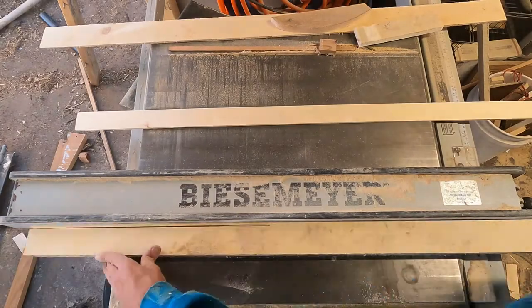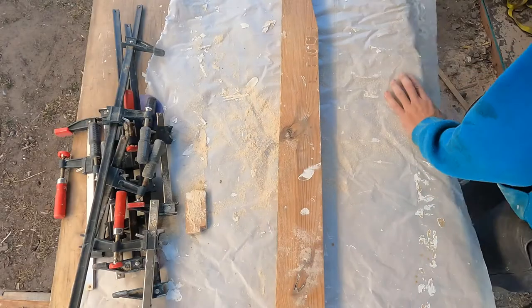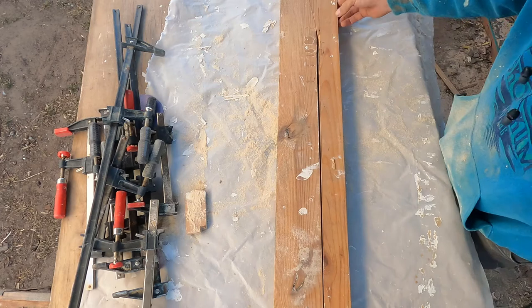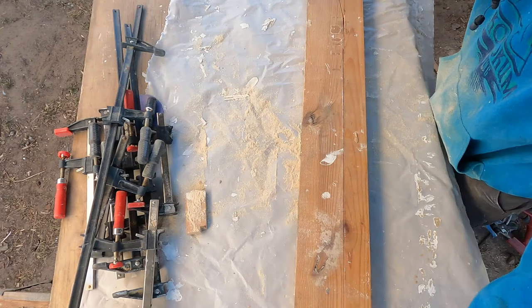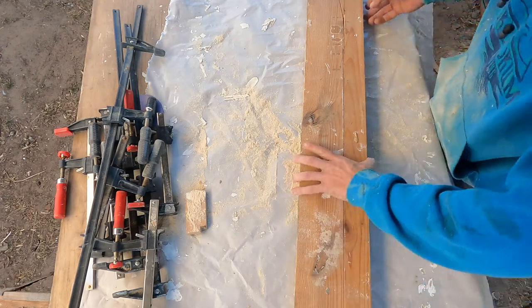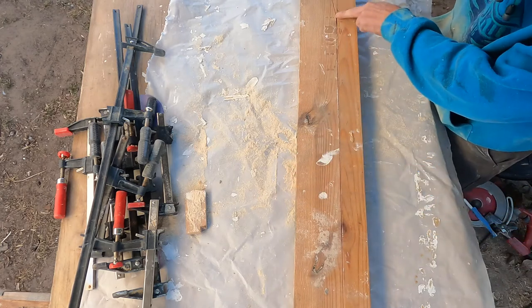To do that, we're gonna first make a bunch of strips so we can make the bent shaft of it. So I made this jig. The way I did it, I just took a 2x6, I cut a 2-inch strip down most of it, and I want my blade to be 14 inches long. I don't know why 14 inches is what I wanted, so that's what I made. And then I put mine to have a 10-degree angle on it.